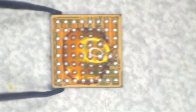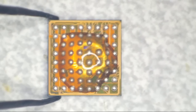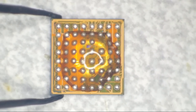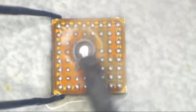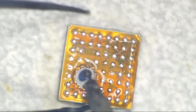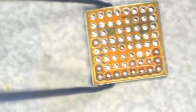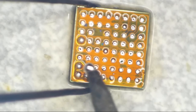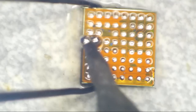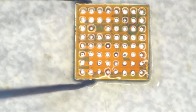So let's get some flux on here. There we go. Now I'm gonna blob some leaded solder all over my 2032 micro pencil with the 0.1 millimeter conical tip. Links are in the description. And I'm gonna do this a couple of times on here because I don't like lead-free solder. Come on, don't overheat that chip. Okay, I'm gonna flux it, do it once more.